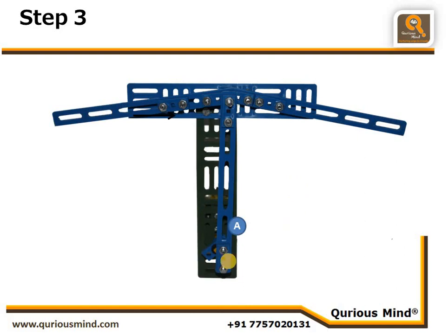In Step 3, here is Assembly A. We put a spacer onto the motor shaft as mentioned in Step 1, then insert the square hole of the dangling flat rotator onto the motor shaft and lock it using the shaft lock. We then take Assembly B and connect it using a nut to the fulcrum point on the double bar, through the circular hole, and the nut is loosely coupled.